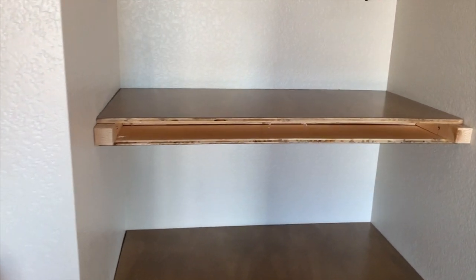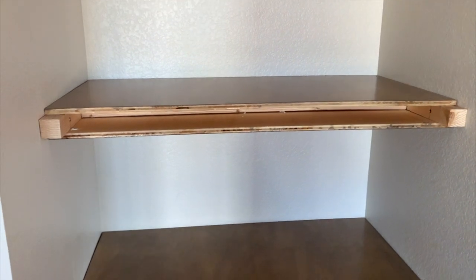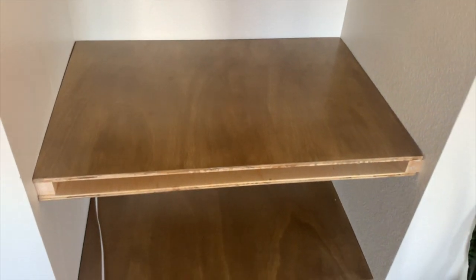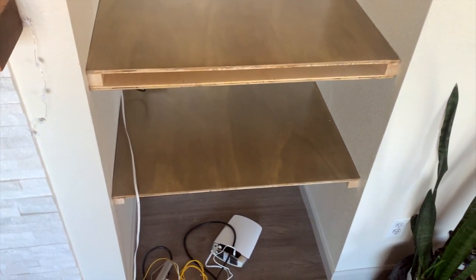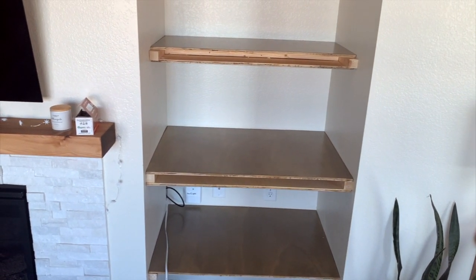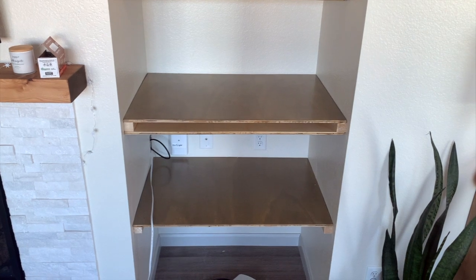So these are done pretty much. I'm just going to go around the corners and the cracks, and I'm just gonna fill it in with paintable silicone, and then I'll take the wall color, which is white anyway, but it's an off-white, and I will paint on the silicone to kind of blend it in with the wall, and then we're done.